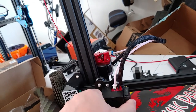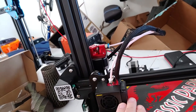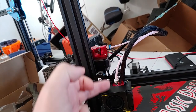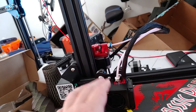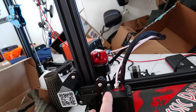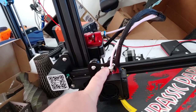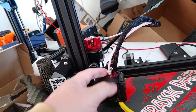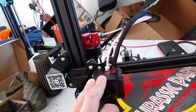This assembly was no problem — standard Creality affair. The wheels lined up fine, tightened up fine. Parts cooling and hot end cooling both work fine. I did have a gap in my PTFE tube, so I had to reassemble the hot end to get rid of that gap because I was getting clogging from it — not heat creep, but clogging because of a gap. I have a whole video on how to take care of that. This is standard Creality affair for the hot end, so it's pretty easy to fix.